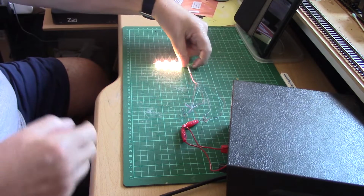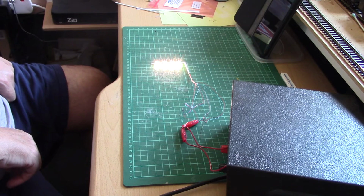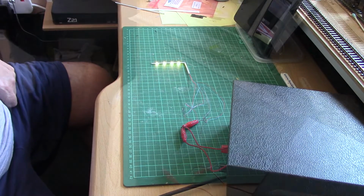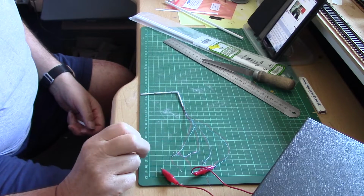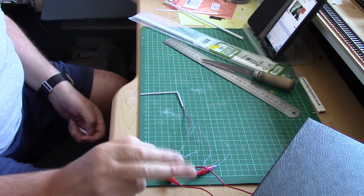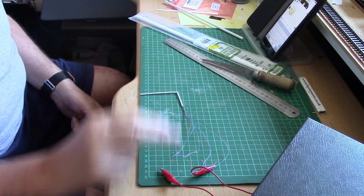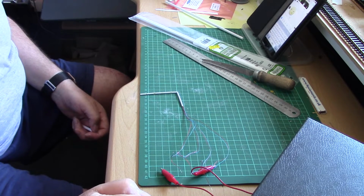And then if I sort out some tube, I'll go and get some thicker tube, and then put it over the top just to show you how that looks. Now, once all these have been straightened out, connected and soldered properly, I use a thin piece of heat shrink to go over all the joints, and if you step the joints so they will not touch each other, you just need the one length of heat shrink to shrink over the whole lot, and that will be okay.